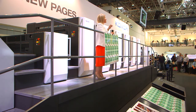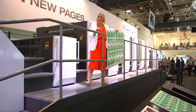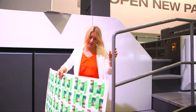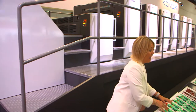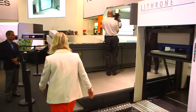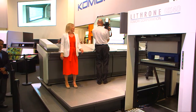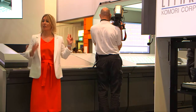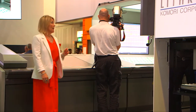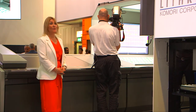And will the number printed by the inkjet sheet numbering system be correct? We're at 18,000 SPH now — that's the maximum print speed. The display on the KID will switch to the version 5 screen. The colour control graph is on the screen at the moment. We'll just see if that camera can do its work and locate that defect.